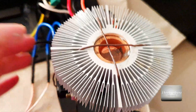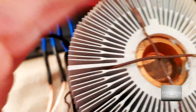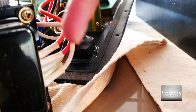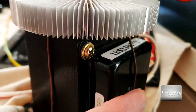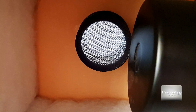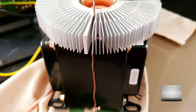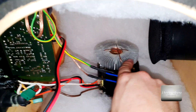So I connected the radiator - it's not rocket science what I did. Between the radiator and the transformer there's thermal paste. It's secured and doesn't get loose. It will not burn because it's pure metal without any plastic. The contacts on this transformer are really well protected - this is 220 volts and they are nicely isolated underneath this protection. I think this also has the purpose of cooling down the transformer. The air evacuation hole will be really near to this radiator and will cool down the transformer. This is how we mount the transformer into the wall.